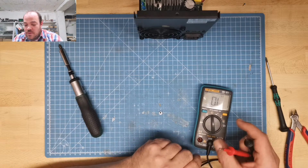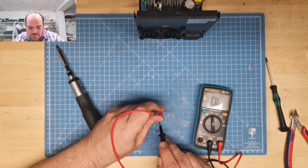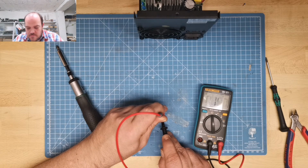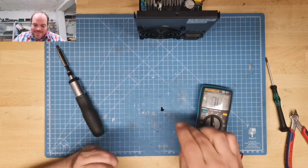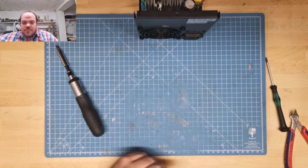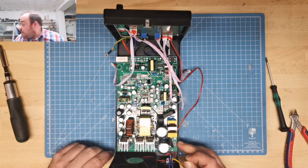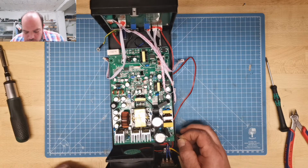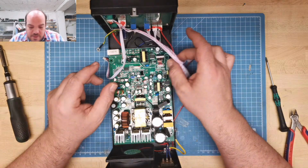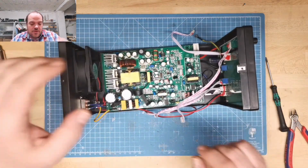One hand flip over. Oh, okay. No. So when I put it together, I will use other screws there to make it a little bit safer, because you don't have an earth connection. The earth lead, okay, it has a little bit of metal here, but I'm sure that is not the best earth connection with this kind of screw, so I will use another kind of screw. Not sure if I get it out now.